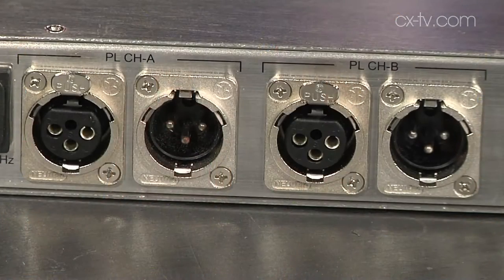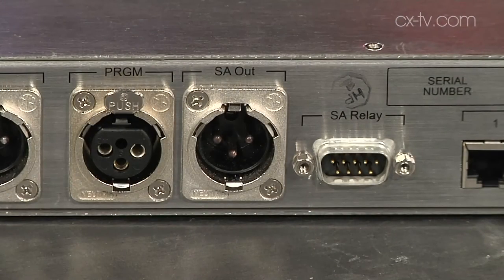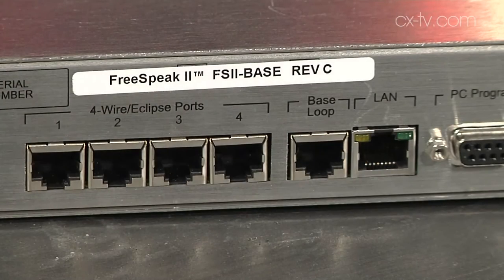So that's very much in opposition to a lot of things that work in the 2.4 gigahertz range, though you can make this run in there. That band is getting very crowded, and that's what people are finding — and that's why this has opened up. In Australia, you can get about 50 channels of full duplex, meaning 50 belt packs simultaneously under optimal conditions. In the US, they implemented DECT a little differently and it's around 20, but you can find ways around that.